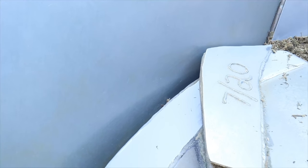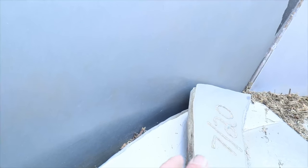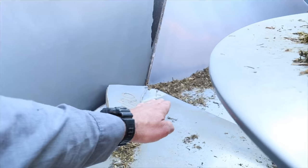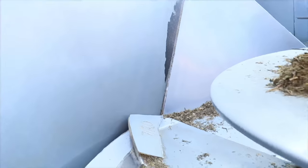Back in February of 2019, we relined this mixer wagon. You can see the liner right here. It only goes up about 4 feet. The original kicker plate is right here, and we were having some grain get settled out, and the mixer would start hard too, so we extended the kicker plate down like that, and that allows the mixer to start better.